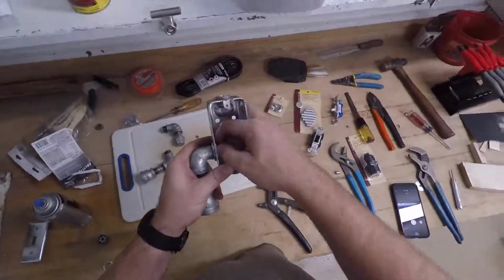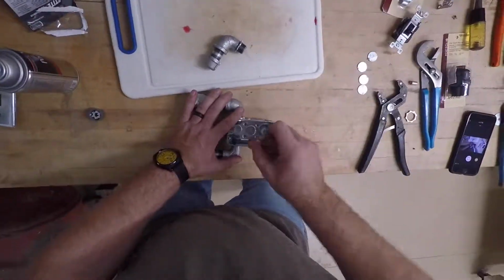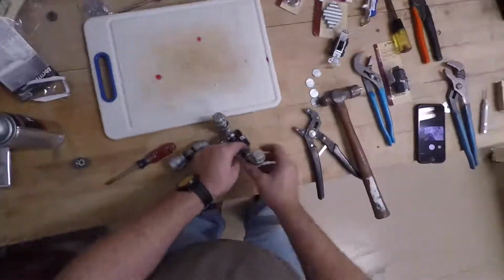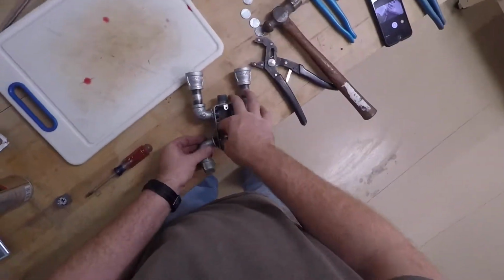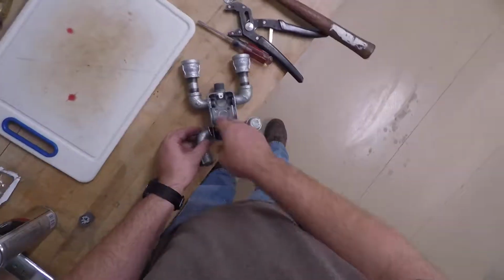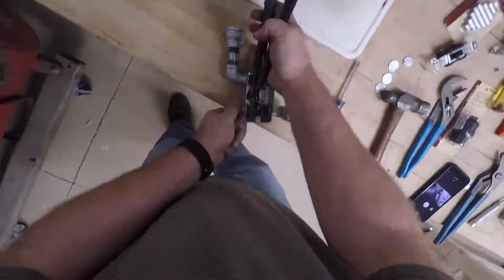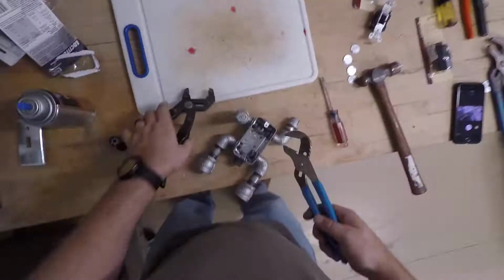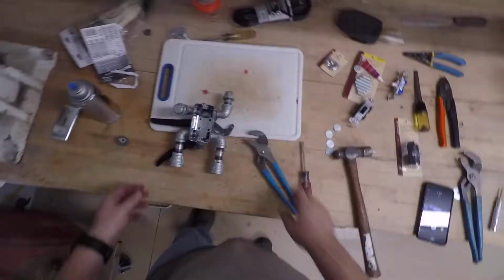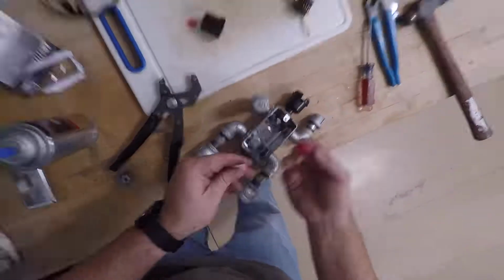And then this is just a strain relief that I picked up at an electrical supply house nearby. When I usually put strain relief on a cord, I don't tighten it down with pliers, but I did in this case. So what I'm doing is I got these half-inch electrical conduit nuts, or Romex clamp nuts, or it seems like they're all the same size nuts for half-inch electrical fittings, which will fit on a half-inch NPT fitting. So those are just electrical component nuts that I'm assembling the fittings onto the box with. I think most electrical fittings are NPT, which is why that works.